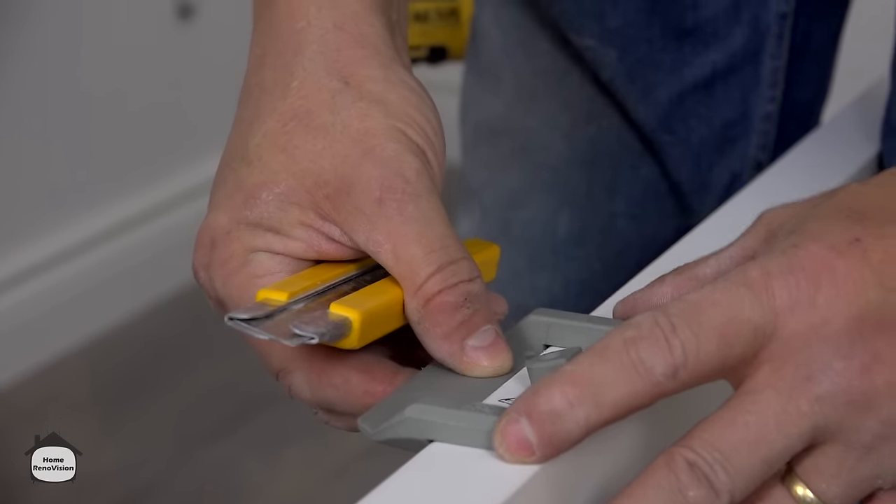If we close the door in the middle — that is really close. I don't think it's worth the hassle to try to make that more perfect. We had a good healthy gap in the middle. When adding an eighth of an inch here and there, generally that looks like more of a sixteenth, and I'm allowing myself space for down the road. When building in a house with a four-season climate, you don't know how it's going to function for four seasons until you've been through them. Right now we're in early winter, the heating system is running, everything is dry. I don't know what it'll be like in summer — we might find ourselves coming back and packing out some of these hinges to create extra space. The point is it's nice to have the option.